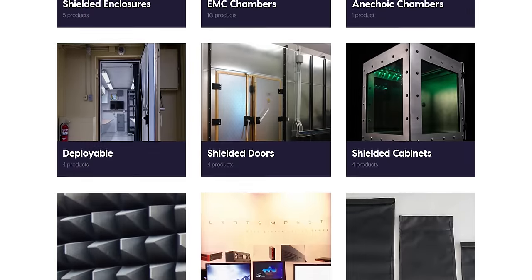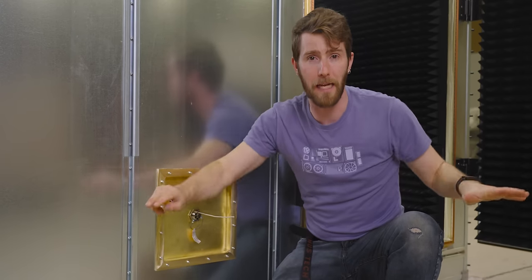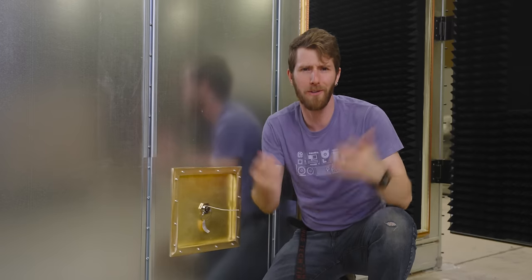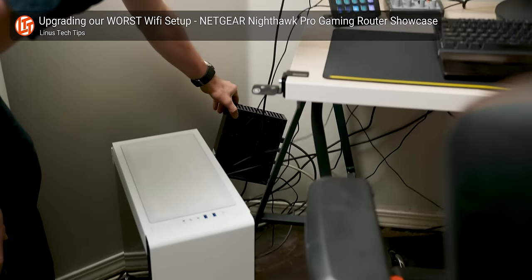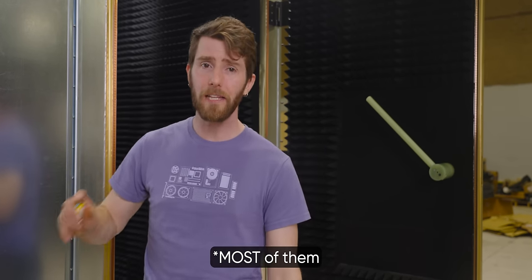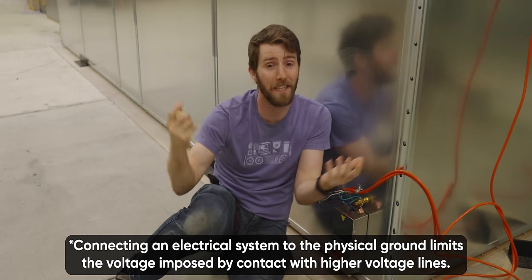The point of my wire-in-the-hole demo was to show that when you want to eliminate background electromagnetic interference, the devil's in the details. Any piece of metal that stands in the way can be a barrier for an electromagnetic wave — that's why we always recommend placing your wireless router away from metal objects, because the wave strikes them, a current is induced, and the wave ends up more canceled than Kanye West. The tricky part is that if you want to get all of them, the electrical charge of the entire enclosure needs to be homogenous — there can be no holes or cracks. That means a tinfoil hat is only marginally more useful for blocking electromagnetic waves than a regular hat, and only one of its problems is that it's not grounded. So shielded enclosure step one is connecting it to ground.